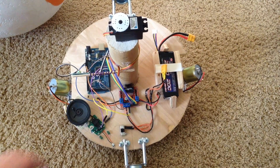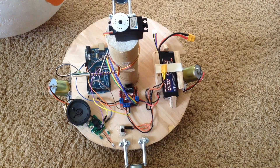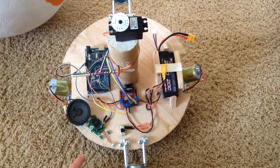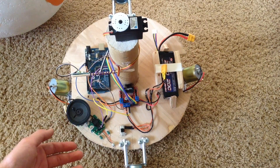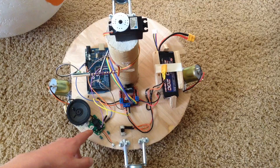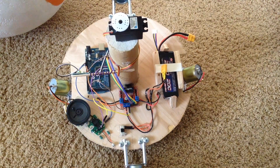This speaker and circuit board allow the BB-8 to make noises. This circuit board is from a generic voice recorder — when I turn on the robot I can record any sound I want onto it. When I press a certain button on my controller, it activates a transistor that's on the play button, and it lets the BB-8 play a certain sound.